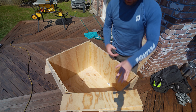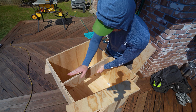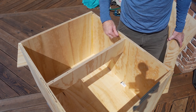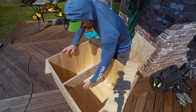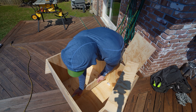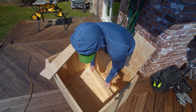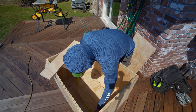What we just cut are two braces that fit inside. One goes essentially here to support this piece, and one goes all the way at the bottom against the other piece — that'll be plenty strong enough to support both sides. We'll glue the ends, glue along here, and screw it in — it'll be very strong. It's also a lighter approach since you're not using a whole sheet in the center. We can slide this down inside. Measure to find center: 28.5 divided by two is 14.25 inches for the center mark.